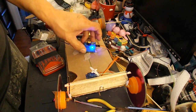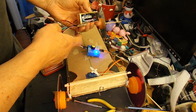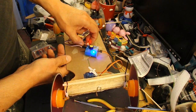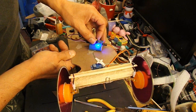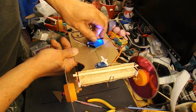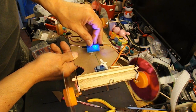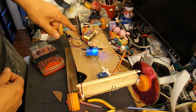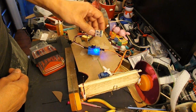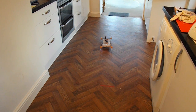Right, we're nearly there. I've just temporarily put a servo tester on there, and a battery, and a BEC. Well, actually it's an ESC, but it'll do. And there's our steering. I've left it all very loose so I can take it all apart again, because I want to use these bits for a different project, but that should do. So I'll put an electric motor on there that we can control with the ESC, and put a radio receiver on there, and we can try it all out. In the kitchen, all up together. I'll give you a close-up of it in a minute, but we'll just see if it goes forwards, backwards and turns.